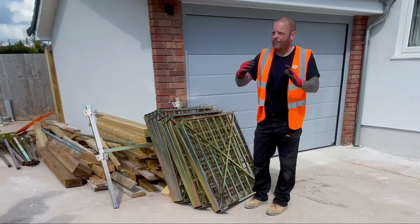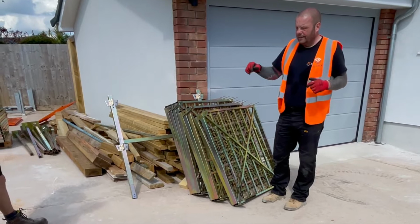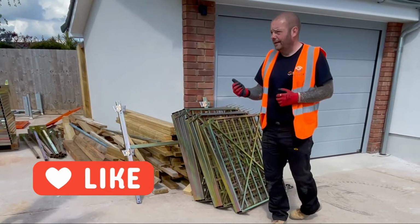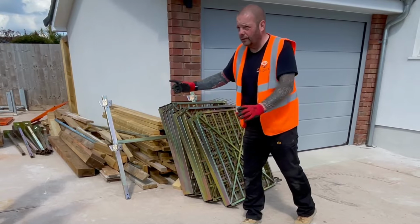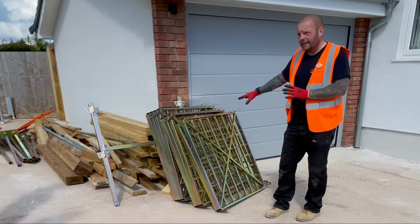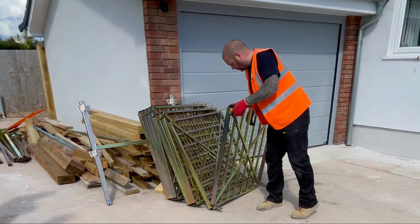Bags, your blow up air bags. This gives you a proper working platform as fall prevention, but also that you can work from. It makes your construction area safer in the respect that you don't need to have the brickies working off the scaffolding. You don't need people loading out blocks on the scaffolding. All the scaffolding could be obstruction free, and everything can come onto the decking, provided your floor underneath is strong. This is when it comes into its own as a working platform.